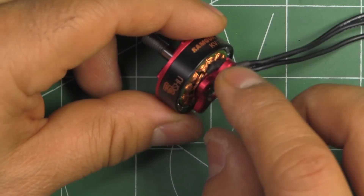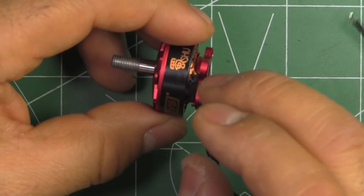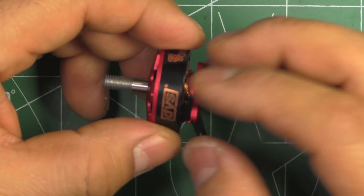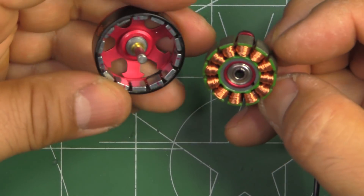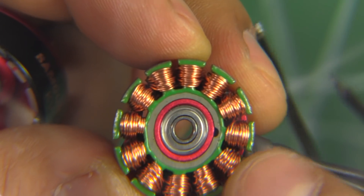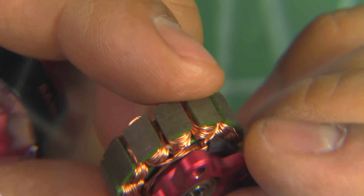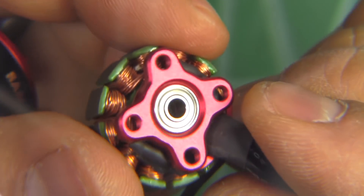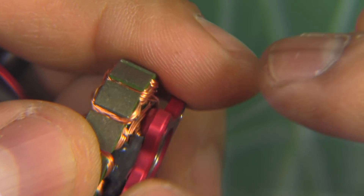The design is different from the other Wu and Wei motors — the spokes look quite nice and each motor uses different colors. Taking out the circlip and pulling it apart, the stator shows a pretty good job on the windings — they look neat. It uses multi-strand wire in bundles of three, with a little glue to protect the wires and keep them in place.